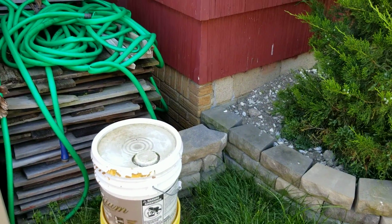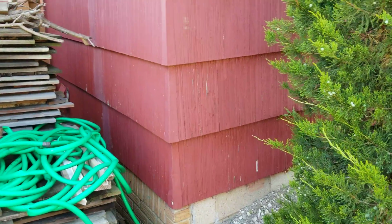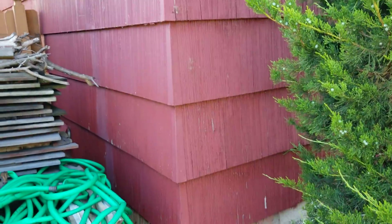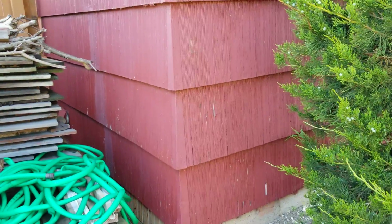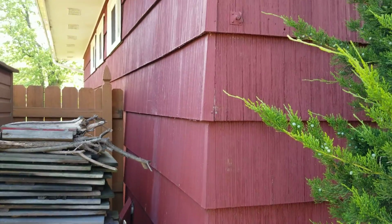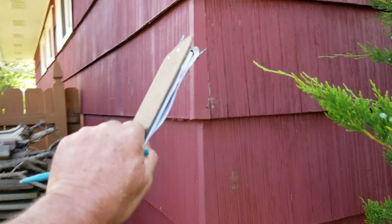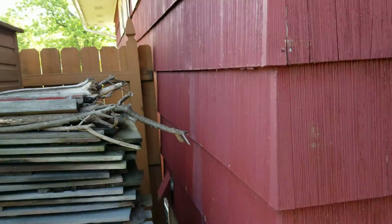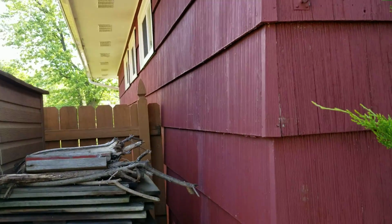Okay, we got a siding job out in Hamburg Way that we're looking at. We're going to give them the option to remove or go over the existing wood shake. The shake is laying fairly flat, and when you go over it with a foam board, you keep the dead air space between the new foam and the shake where this lap is here. So you create a dead air space when you go from top to bottom, and that helps the R factor of the board. So we'll give them an option from a 1/2 inch up to as much as an inch.